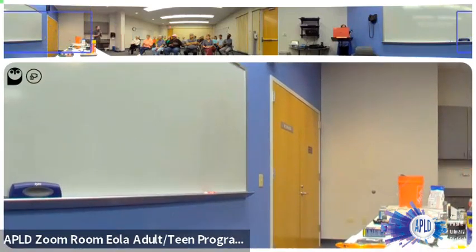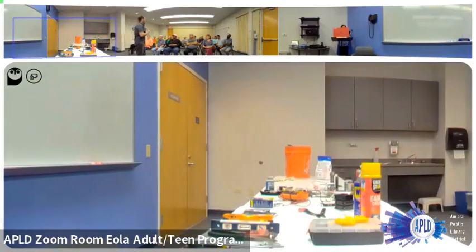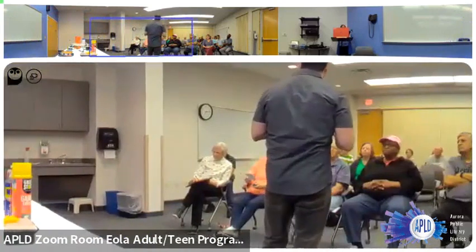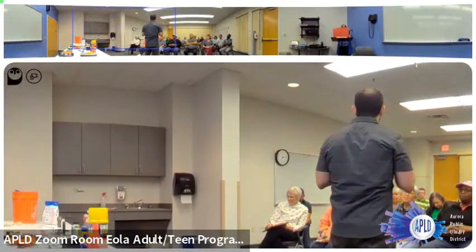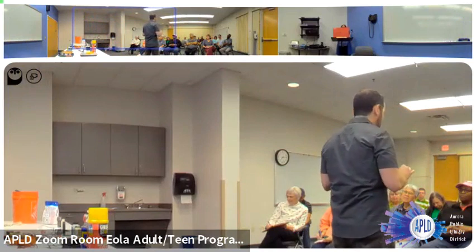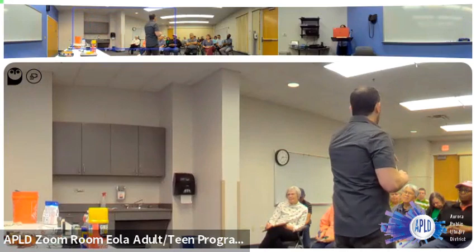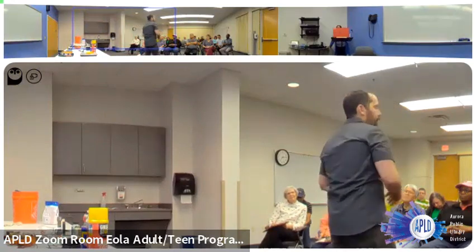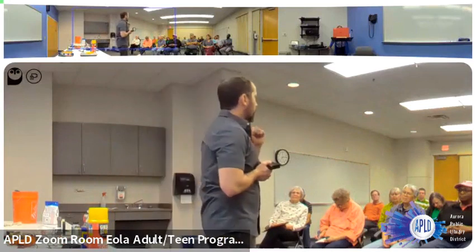And it's cool because it comes with a tiny little screwdriver in it that you'll never need. Okay. This is a non-contact voltage detector. You must have a non-contact voltage detector. And the reason is this. I plug that thing in, it tells me the outlet's on. I go to the breaker panel. I hit the breaker. Then I go ahead and start taking things out.